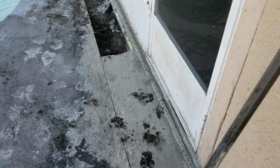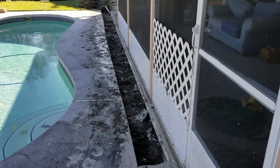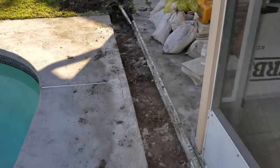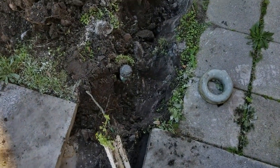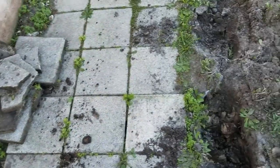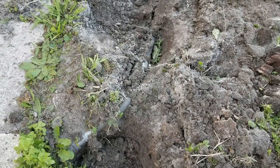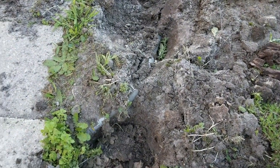Just two more pieces, then we'll wash this off, pull out the old channel drain, and we've got a nice clean trench to work with. We went ahead and explored both ends — this side looks good, but the other side has some obstacles we'll have to go around. We've got a sprinkler irrigation line coming through there, and there's also a power box — actually just underneath the pavers, very shallow for an electrical conduit. That's the pool light — it really seems like it should be a little deeper.